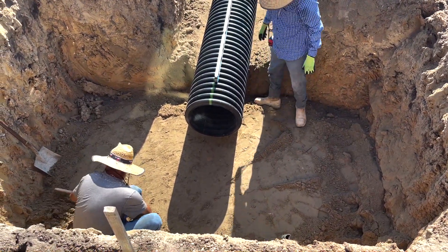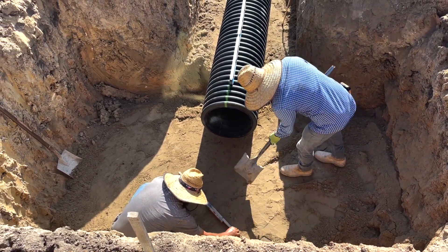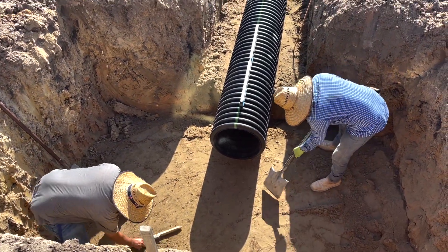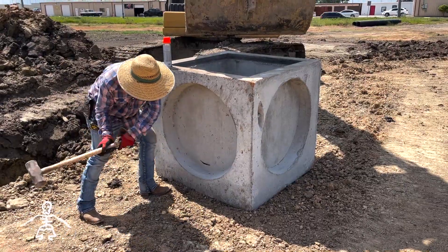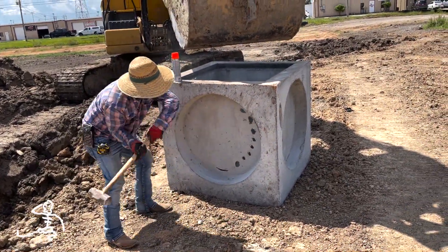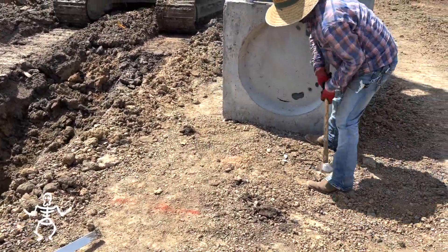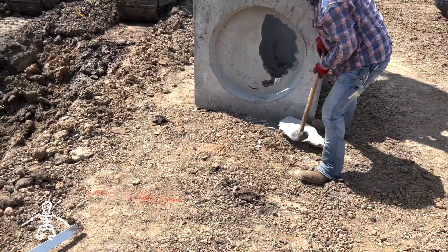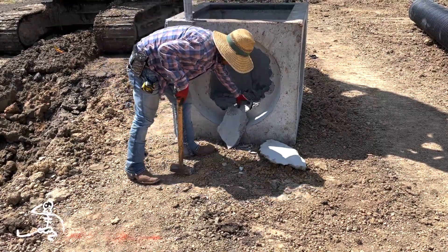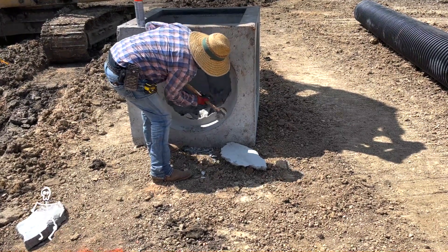Make sure that pad's level. Take that level, put it down, scrape it, cut stabilizer sand. As that cement starts kicking in, that stuff's getting hard. It's hard.